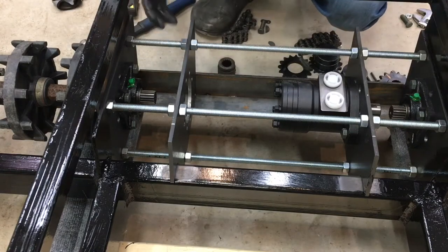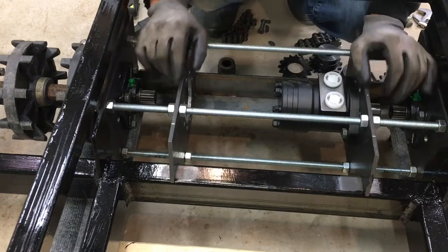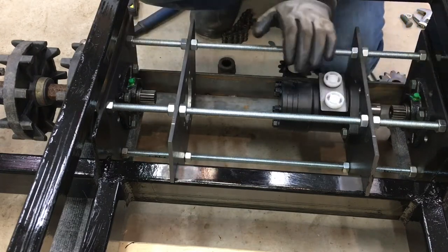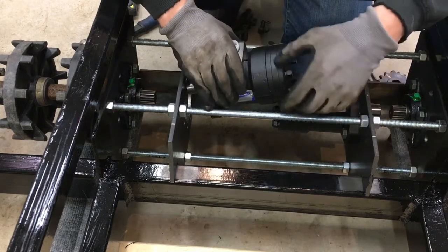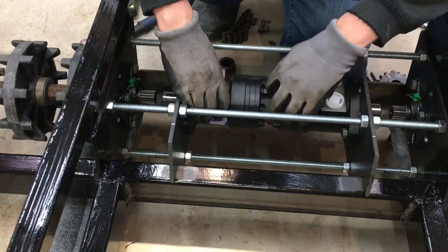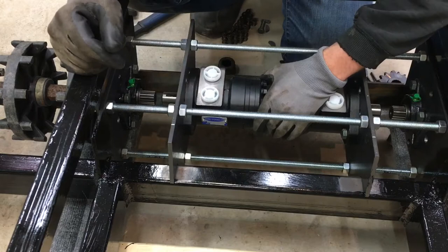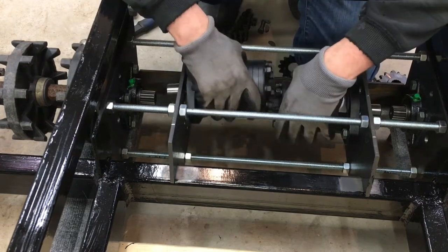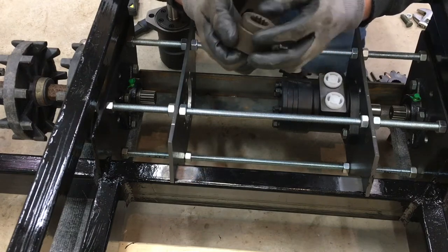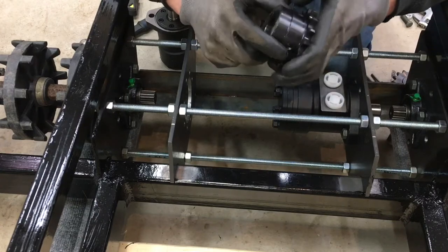Just for a test, before I start to machine about three eighths of an inch off that hub, I moved and set these two plates so that they are now three eighths of an inch closer on each side. That would give me enough space to set up the chain, and with one motor in against the other — able to just slide it in without any issues. Having three eighths and three eighths gives me a three quarter inch gap in the middle, and everything can work very happily. So I think I'm just going to stick with that — I only need to take off three eighths of an inch from these two hubs. This other piece would be a little bit harder to chuck up, so I'm probably just going to leave it as is. That should be a pretty easy fix for this little issue.